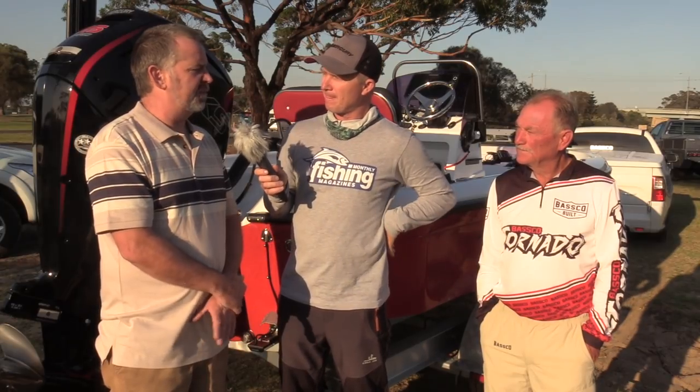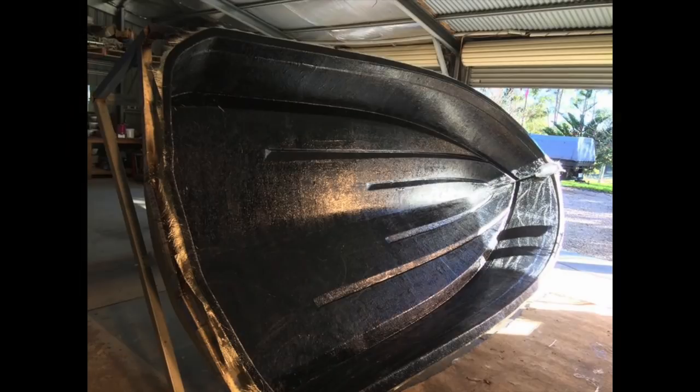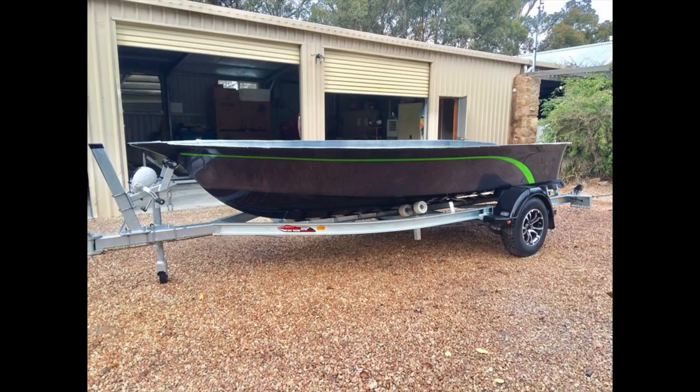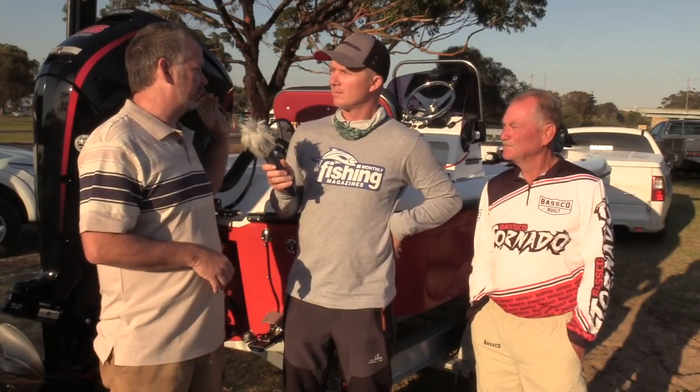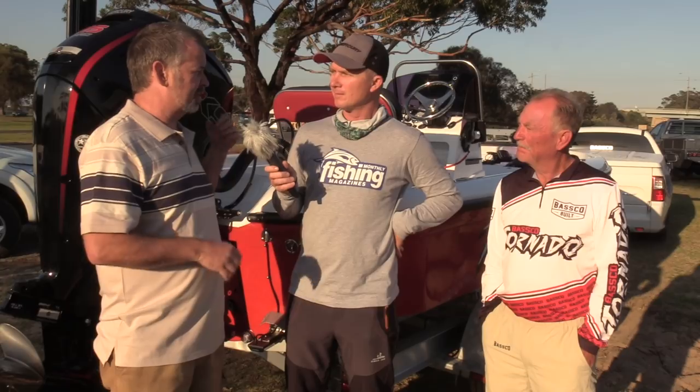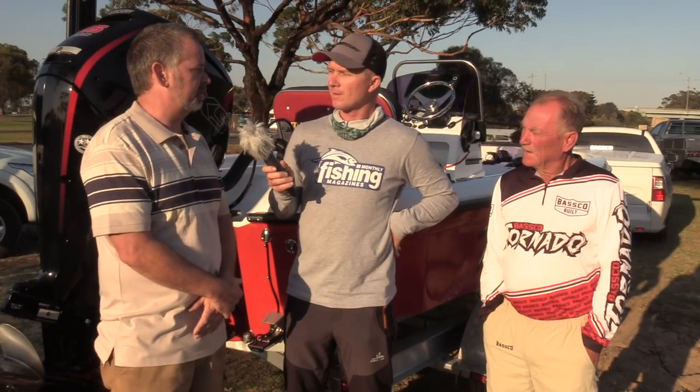Give us some of the technical specifications. This is a fibreglass boat. It's got no wood in it, and it's built with all the modern materials. Give us the rundown. Okay, thermalite transom, full glass construction, no timber anywhere, moulded glass stringers, pump full of flotation foam, very rigid design, no tagging anywhere, old-fashioned design. The hull is fully glassed on to the deck, so there's no lightweight materials used. It's basically built to be taken out and used as you should use a boat, or shouldn't use a boat, depending on who you speak to.